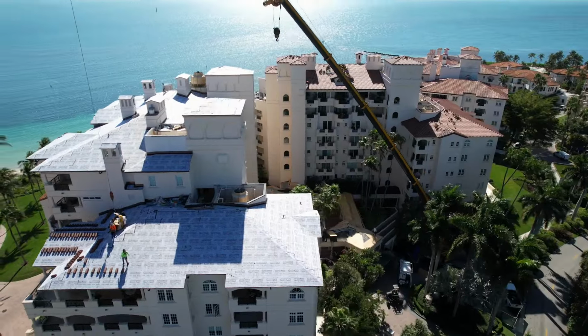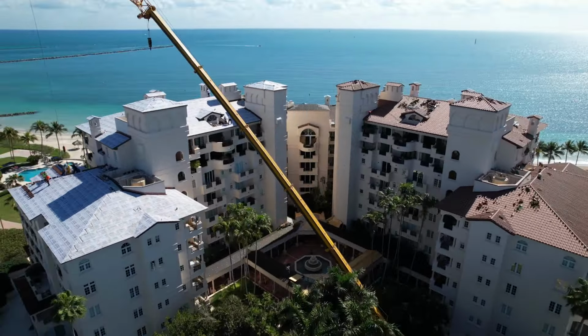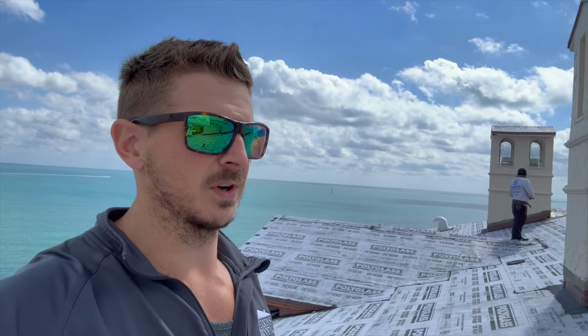So you see we're unloading tile on one section still. We have coating of the interior and exterior cupolas going on. We're getting the center roof completely dried in. The north roof is now completely dried in with the TU Plus and the MTS. So secondary water barrier system. This is a 30-year roof that they're getting here. And then the tiles are all finished on the north section.